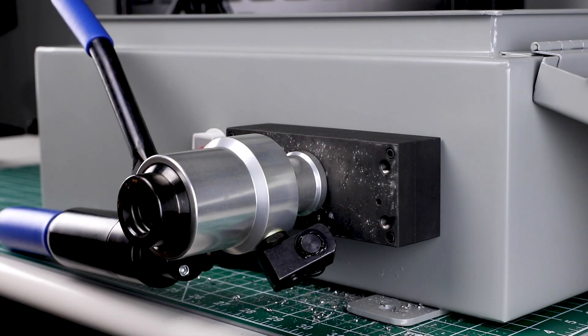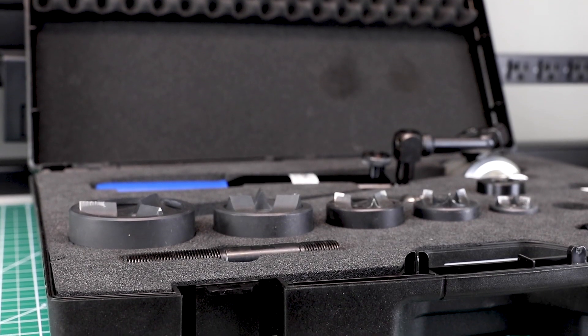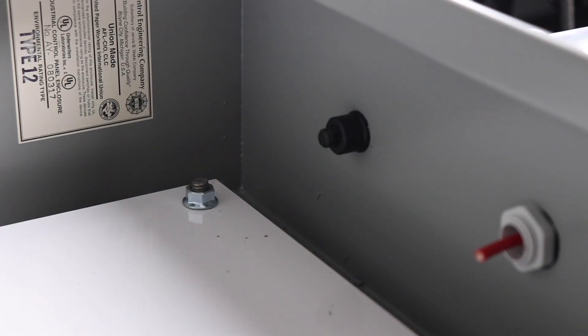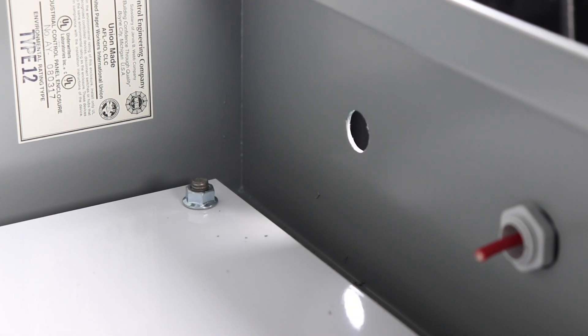Due to its high hydraulic force, the compact, lightweight Hand Hydraulic Punch Driver makes it easy to punch holes into stainless V2A steel, mild steel, aluminum, or plastics — with a max sheet thickness of 2mm on the V2A steel and 3mm for everything else.